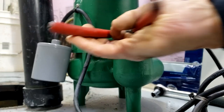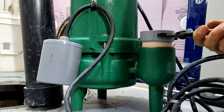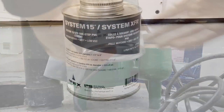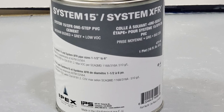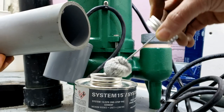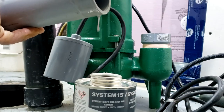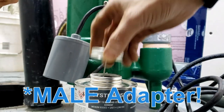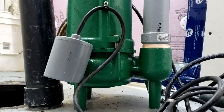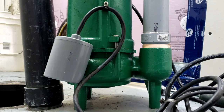Because we're dealing with PVC System 15, we are going to use special PVC System 15 one-step glue. We'll take one side of our 36-inch long piece, apply glue to the male side, and equally apply glue to the female adapter. Some of you may be wondering why we're using PVC 15 when we have ABS in the system — well, there's a specific reason for that, which we'll get to momentarily.